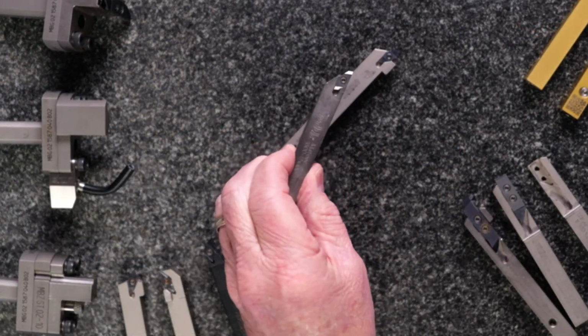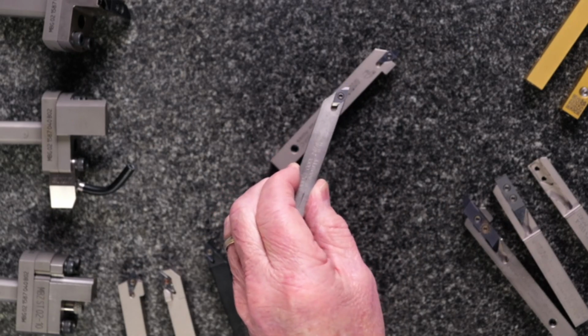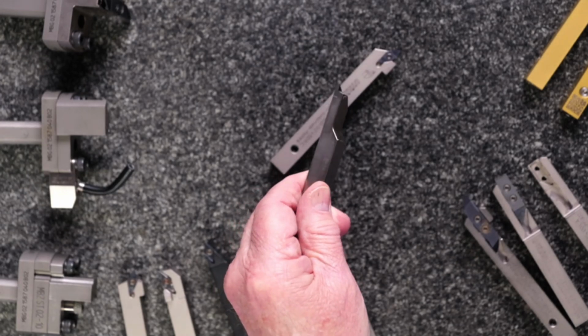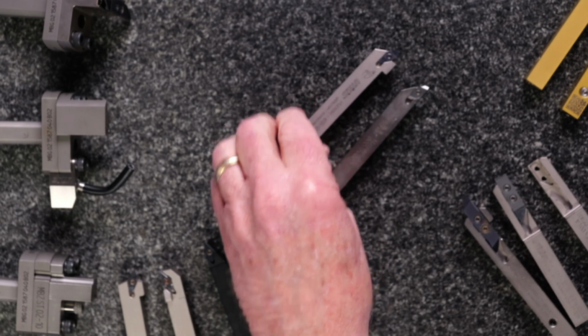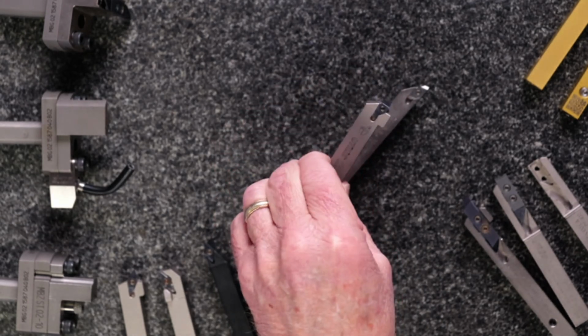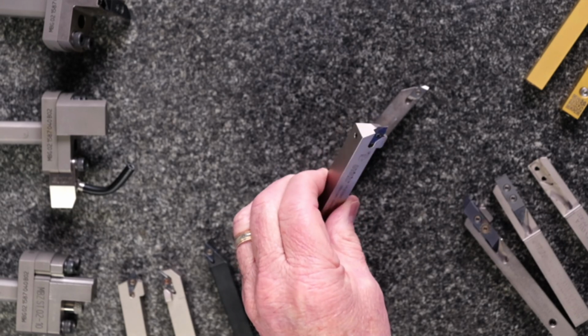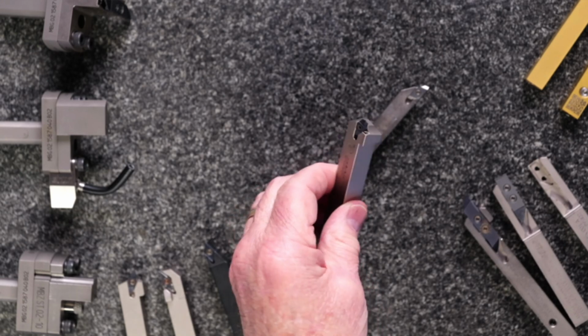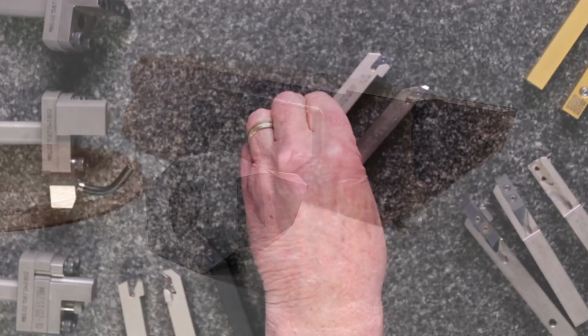Same situation, where one holder will accommodate all the different geometries, and there's somewhere in the range of 12 standard geometries, ranging from cutoff all the way through grooving and threading and front turning and back turning, you name it. We have all that available. But the difference being, these are all either zero radius or very small radius, and really ideal for doing work